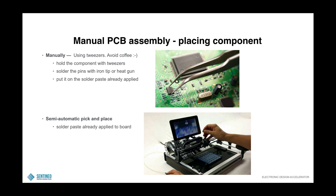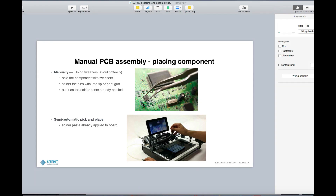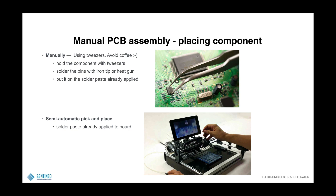If you're not using solder paste and just soldering tin, what I would do is before placing a component, put some solder tin on one of the pads. So on this pad for instance I would put a small blob of soldering tin with the iron, and only then come in with the tweezer and place it while heating that point with the iron. In that way there is one point of the component that is already fixed. Then hook up the other side diagonally and put some tin on there. The component is then already on the board and you complete all the other parts. That's some advice for SMD manual soldering.